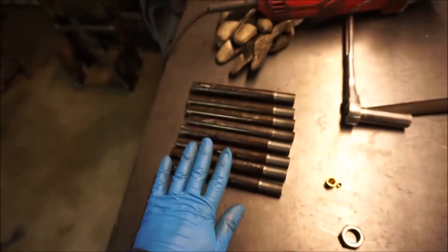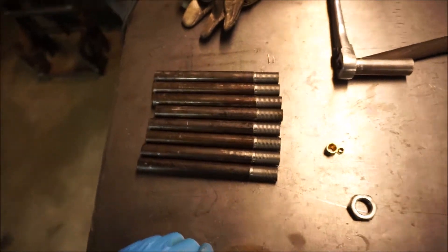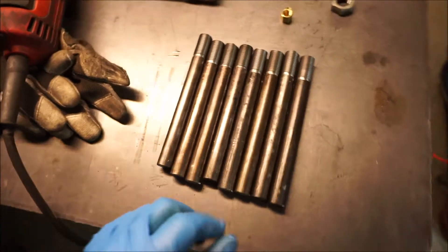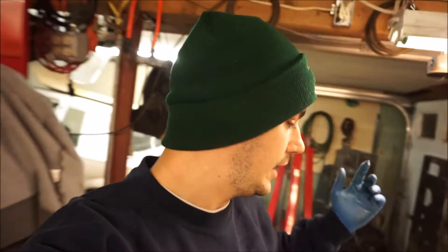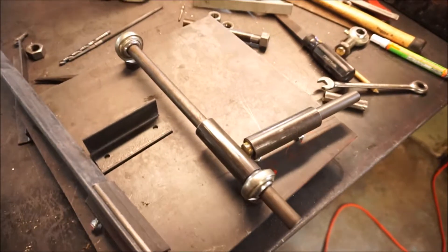I'm going to use chromoly for all the shafting on my spindles, and use a little regular cold roll too, but anything that's going to be really high stress I always try to use chromoly. Next up, after I clean up my shop, I'm going to be working on making a jig setup so I can do all eight of those, and any future ones — I might change the geometry a little, so I'll set up the jig to hopefully allow adjustment.